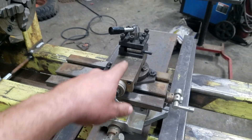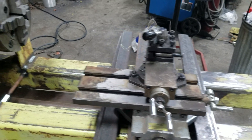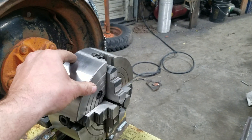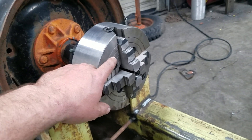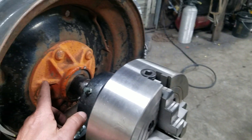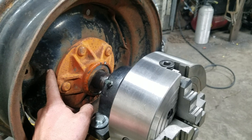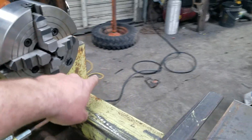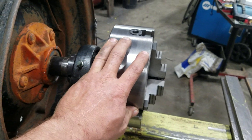This table I had laying around — didn't have to buy it. I'm going to get a different tool holder, probably a quick-change. I've got this chuck here, also not purchased for this project. It's a four-jaw non-self-centering chuck, so I can move all four jaws independently and put whatever I want in here — round stock, a yoke, whatever. I used a trailer wheel with a hub and trailer bearings, but the wheel flexed a lot, so I put a carrier bearing back here with a frame on each side to hold that assembly, and that added a ton of rigidity so the chuck isn't moving.